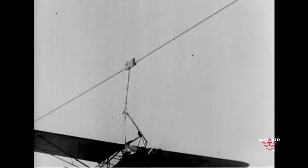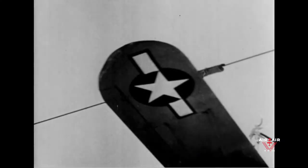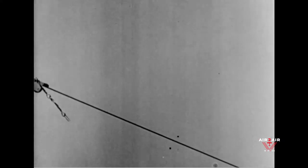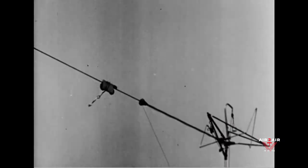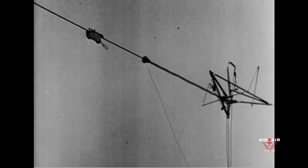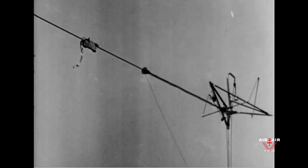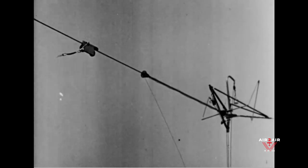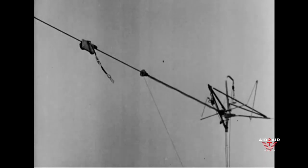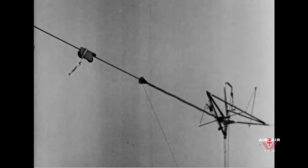When the plane takes off, the takeoff trolley slows down and slides to the end of the runway cable. A spring coiled around the cable stops the trolley, acting as a shock absorber. At the end of the spring is a cone. The cone is not attached to the spring. It is controlled by a slider rope, which reaches the ground through the third eye of the triple-eyed fairleads on the bridle cable. This device is used so that a man on the ground can slide the trolley back along the cable for the next takeoff.